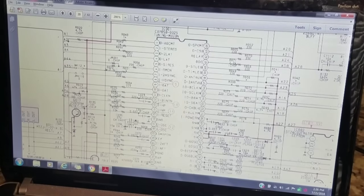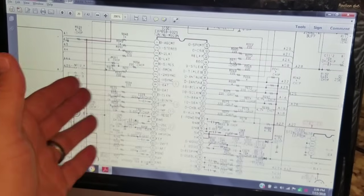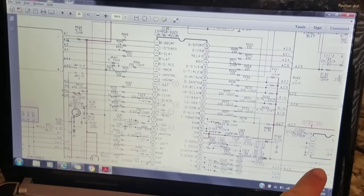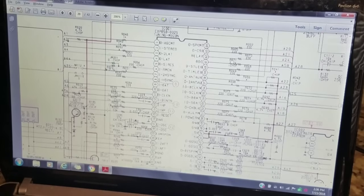This is the service manual I had to go find for this specific television. You have to find the service manual for your specific television so you know how it works and where to tap into things. This is page 20 of the manual — it breaks down all the chips. This is the micom chip, which is the chip that actually sends the operating display, OSD and the blanking signal out. That's at pin 42 down at the bottom where my finger is — it says blanking over here, and if you keep following that you'll see where it ties into the jungle chip. That's where our lines fed up and where we need to split into.